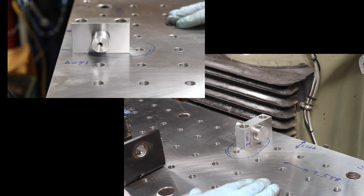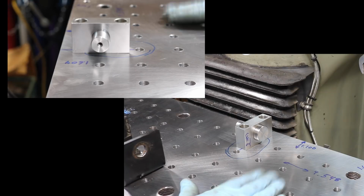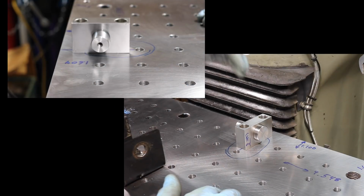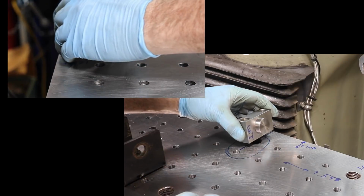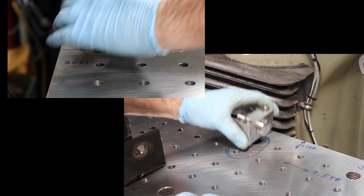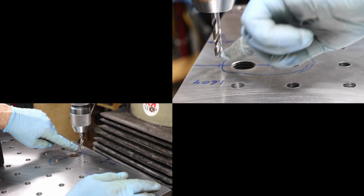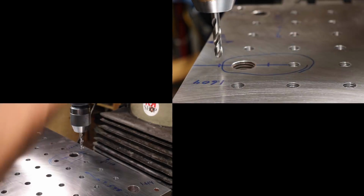Now the plate is about 920 thick, not about, it is. And we're only going to drill 3/4 of an inch into it. I don't want to have extra holes on the top, so we're just gonna drill and tap those and mount this block on there. Yep, center line of these holes, 10 inches over. Well, it's 10 inches over to the center line of the holes there, and we're in a little bit.